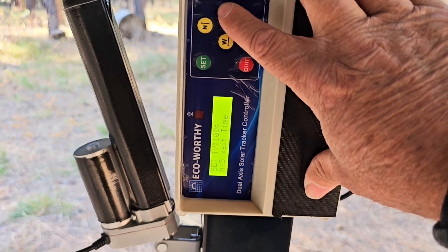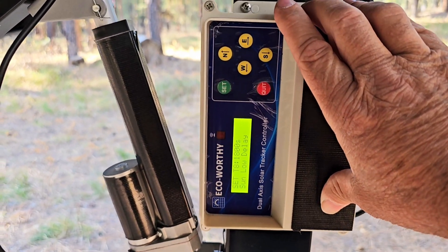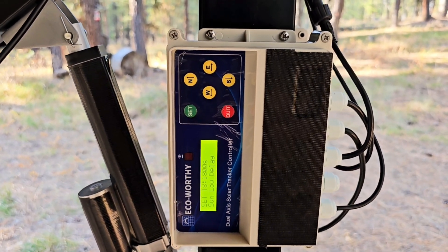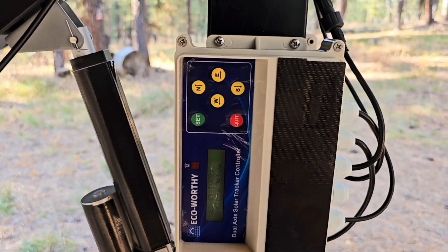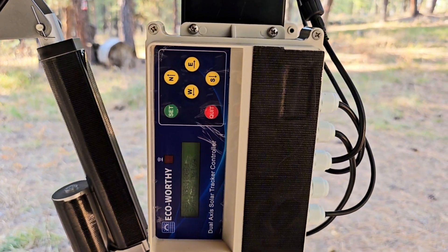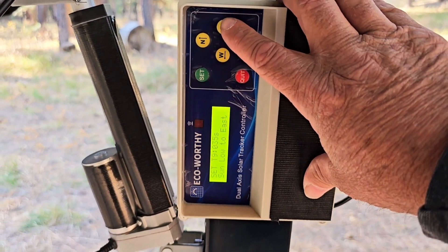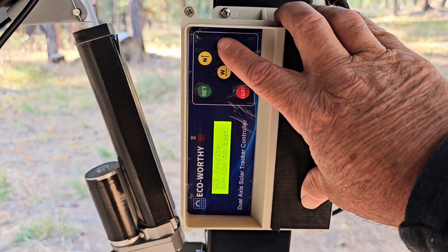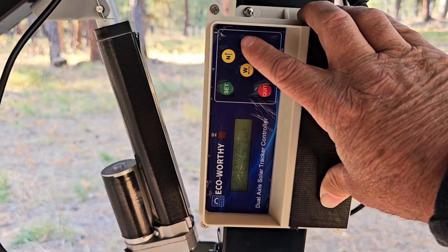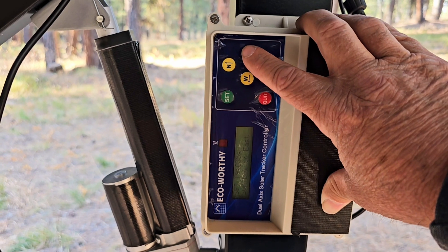Toggle through T4, T5, T6, T7 until you get to T8. That is the delay — if the unit does not see the sun for this set amount of time, it will return to the position that you set. Mine is set at 1,800 seconds, which is a half hour. If the sun doesn't come out for a half hour — it's behind clouds or whatever — it will return to the set position. T9 is the time you wrote down to move all the way from west to east. You can fudge that by a couple of seconds. Mine took about 32 seconds and I programmed it to 35 — it'll just pause for a few seconds on the other side.